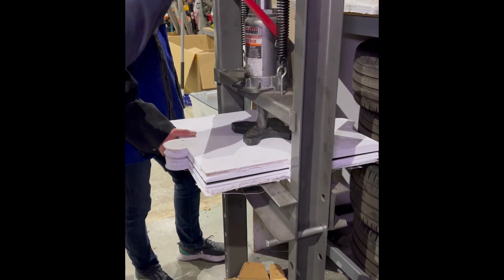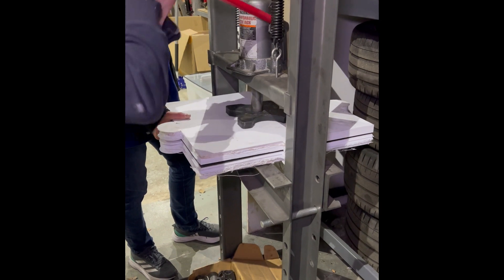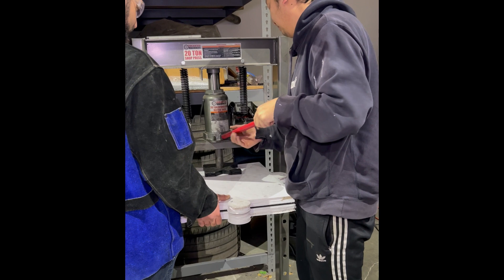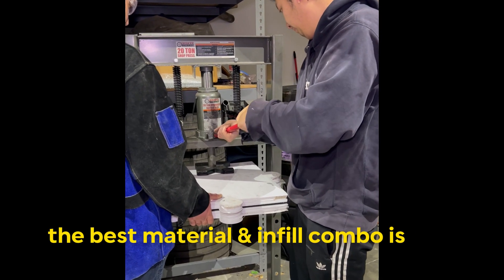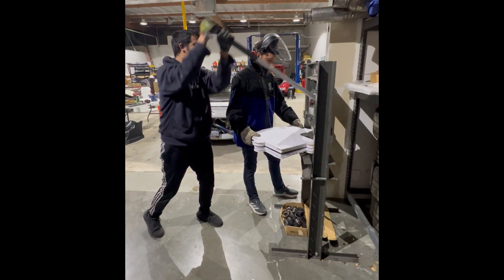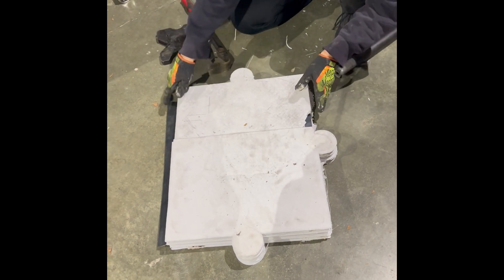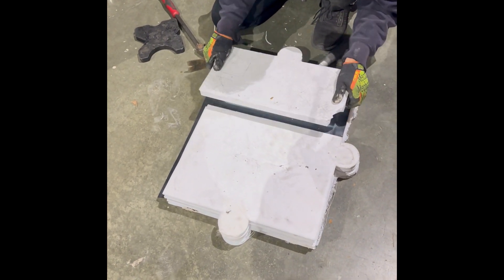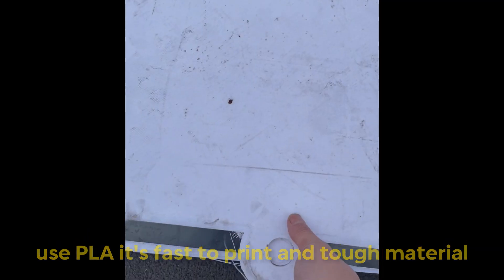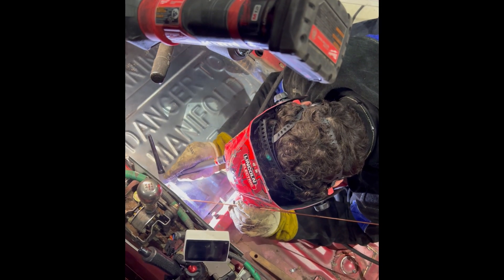I didn't actually print this with enough infill, which raises the question: how much infill should you use? After a bunch of testing with other materials, I recommend the best material and infill combo is PLA at 75% with some kind of concentric infill pattern, so that you have all the strength in the Z direction. PLA is super easy to print, fast to print, and also super tough. In summary: PLA, 75% infill, concentric infill pattern for strength in the Z direction.